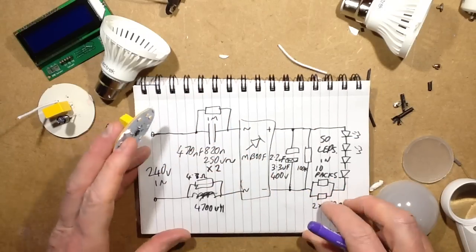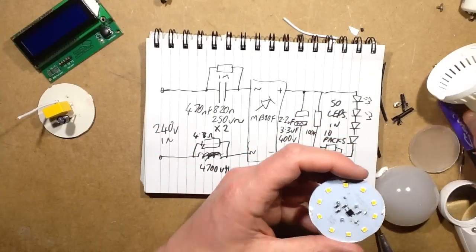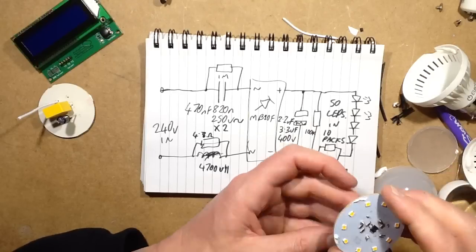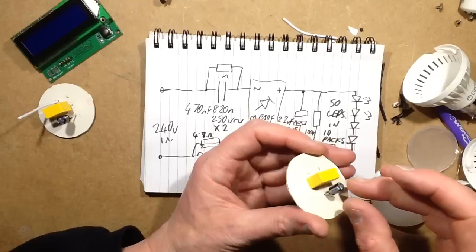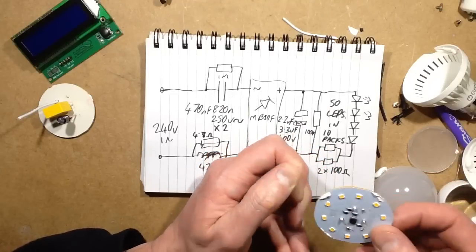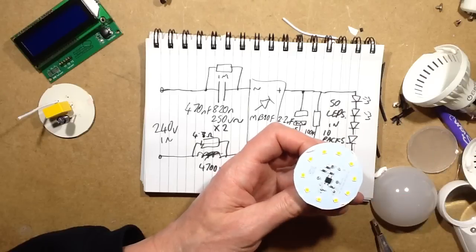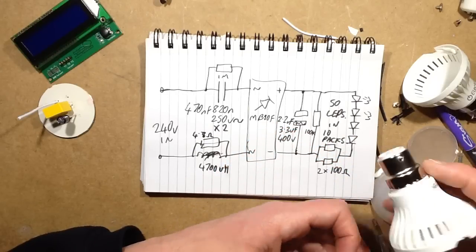That kind of means that this lamp, the 3-watt lamp, is identically sized to the 5-watt lamp, but it's being run at almost half the power for the same component ratings. So that means the 3-watt one is potentially going to last a good length of time. Note again, the electrolytic has been sat up a little bit to keep it away from the hot surface, although it's not going to get that hot. I like that one. It's nice to know that it's rated for 5 watts, but it's being run at 3. I'm going to have to get more of these as well.